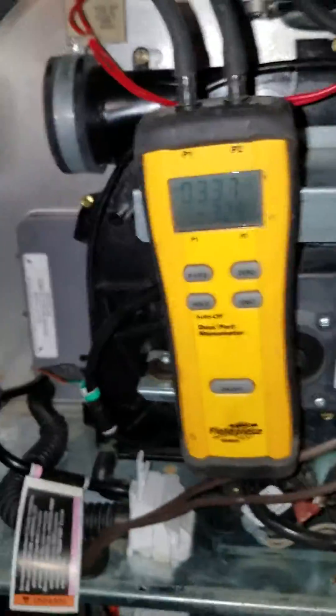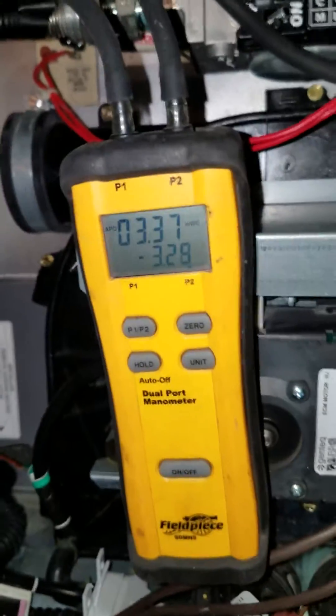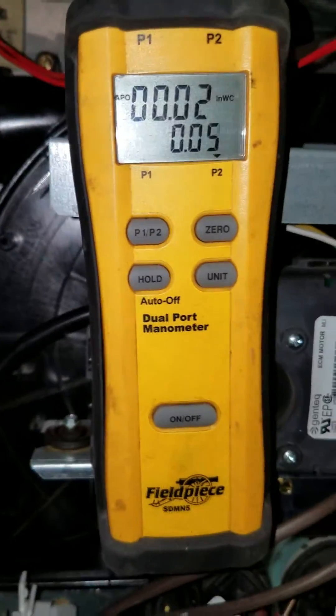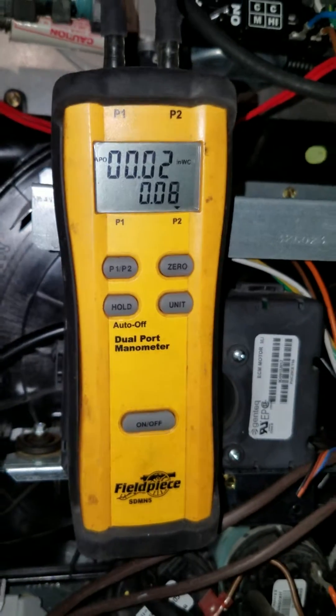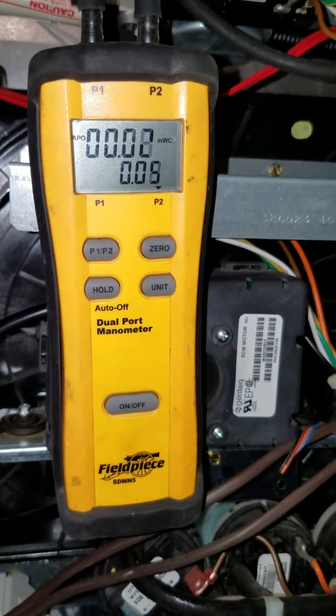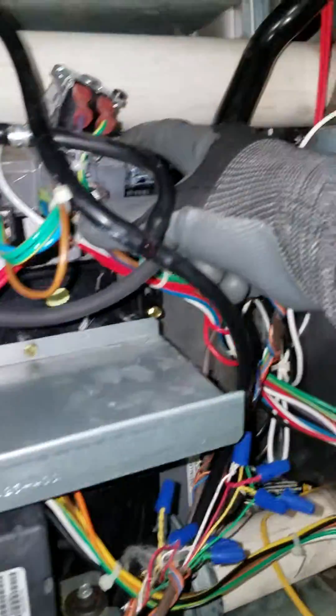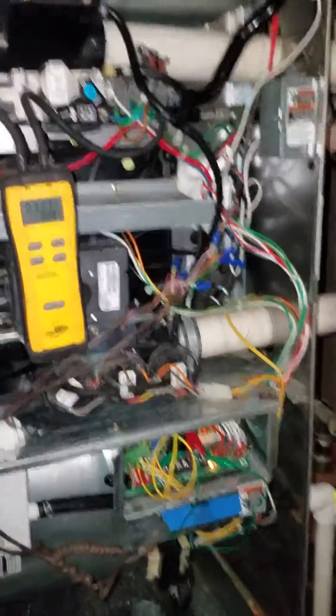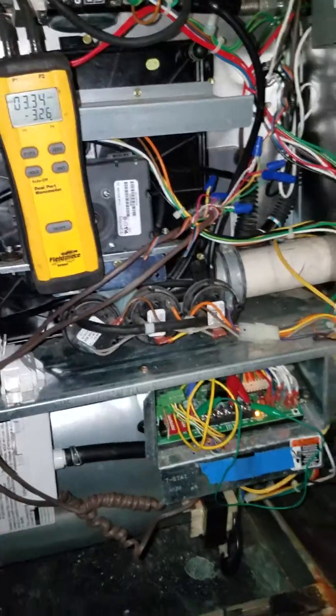Now I want to point something else out. The manometers can drift over time, so I'm going to pull this off and show you what I'm doing. I pull it off and plug that. So now my hose is open and I'm going to look at this — it reads 0.02. So it's actually still pretty accurate. Sometimes you need to zero it, especially if you're running pressure on it for too long. So put this back on. I guess I was just putting gas into the house — not that safe, but sometimes you've just got to do it real quick.